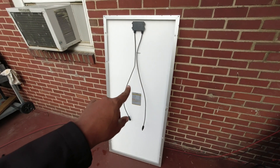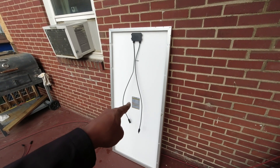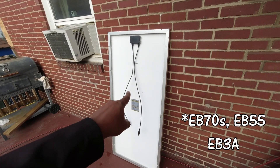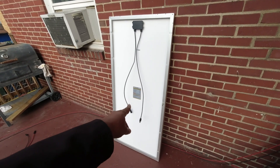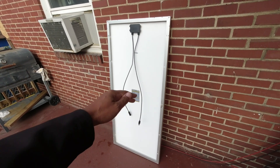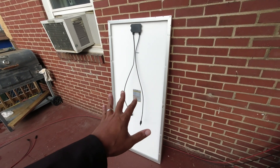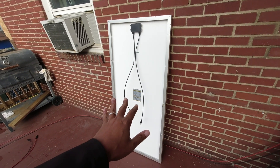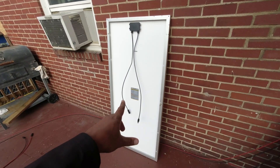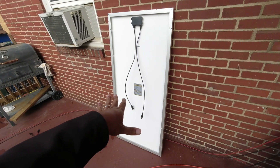The reason why that's a good look is because our Bluetti devices — their own Bougerv Bluetti clone — they max out at 8 amps. The benefit of a panel like this is because it has a higher open circuit voltage of 23 that drops down to 19, with lower amps. This panel pairs well with those devices because they have that 8-amp limit.